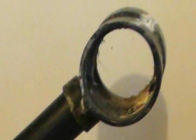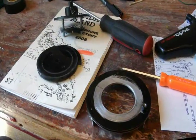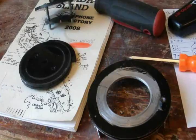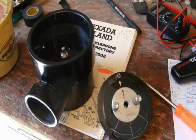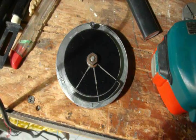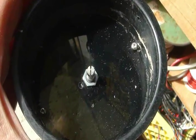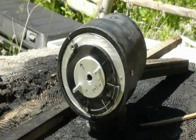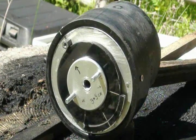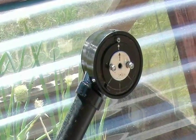It started out as a PVC pipe T on the end of a PVC elbow and a T at the base. I cut out three layers of plexiglass discs — one with limits for the steering. The structure needs to be tough for kids, so the layers are bolted together and ride on an aluminum plate. This turning section rests above a potentiometer. The weak potentiometer is just linked to the discs, so there's no strain on it at all. It is mounted on another layer of plexiglass further in. The steering wheel mounts onto two bolts, which will turn the layers and pot, but will stay rigid in the aluminum hoop.